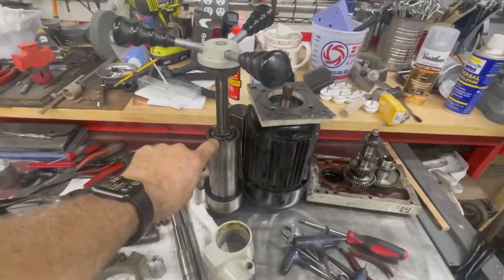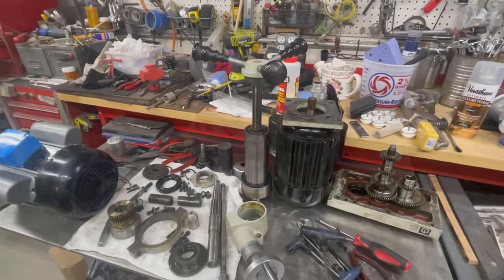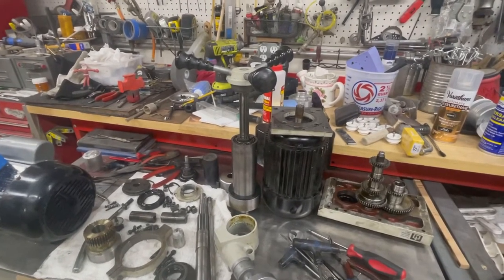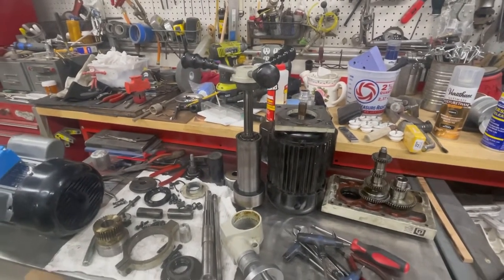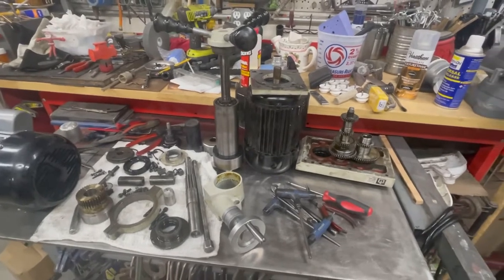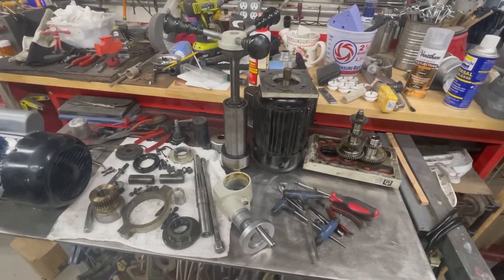And here I see where the problem lies. It's got a nut that tightens the bearings in the quill. And those bearings have relaxed enough for me to have 32 thousandths of play while the thing is cold. Probably more when it's hot because that tube's gonna get longer. So now I'm gonna get seals out, get some bearings out. I gotta order some parts, probably go to Kaman. And then we get to see a very detailed story of how to put it back together. Yahoo.